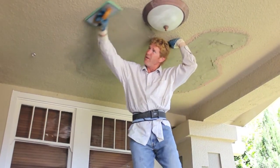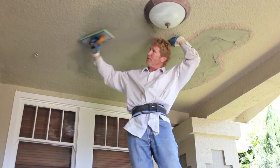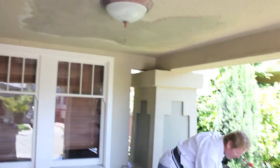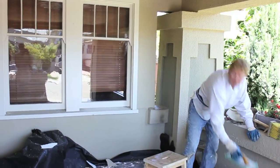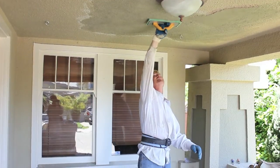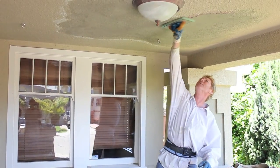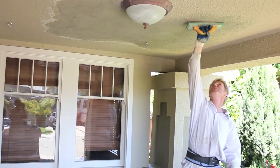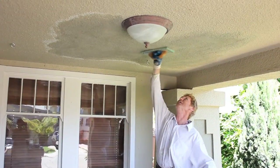We're going to be right on the money. My float is flat — completely flat. Floating in the joints and I push it up, otherwise it does have a tendency to fall. I'm finishing up the float on both of these little patches. One of the benefits — really the only benefit of being really tall — is I need a ladder to get to this ceiling but I can see what I'm doing a little bit better without standing on the stool. Disadvantage of being tall is I've got to bend down for everything — in the sink, kitchen sink, bend for everything. Anyway, here we are floating it out. We're bringing this aggregate out. I'm just going to go ahead and dash it now.